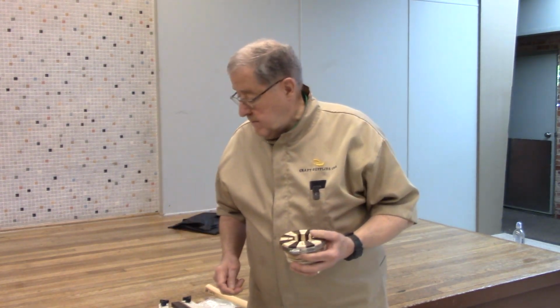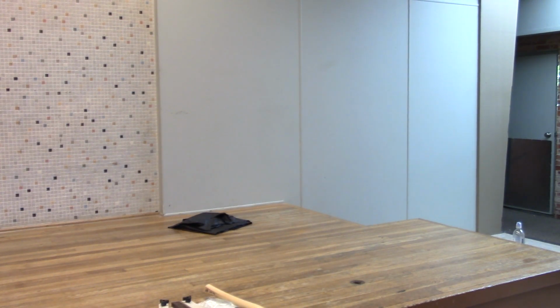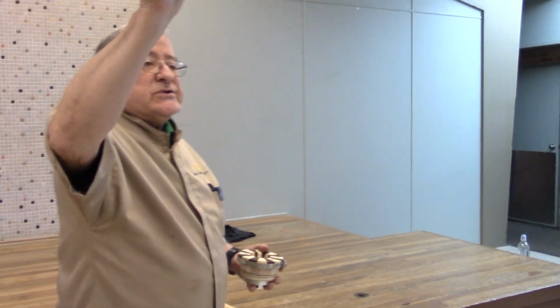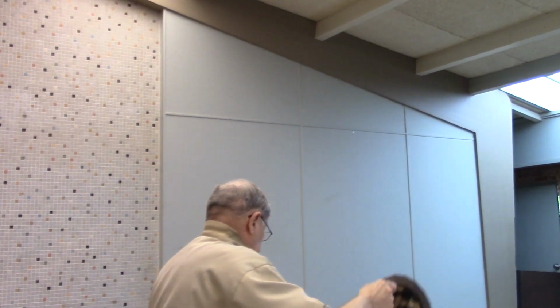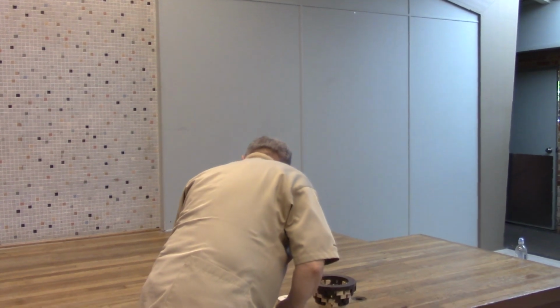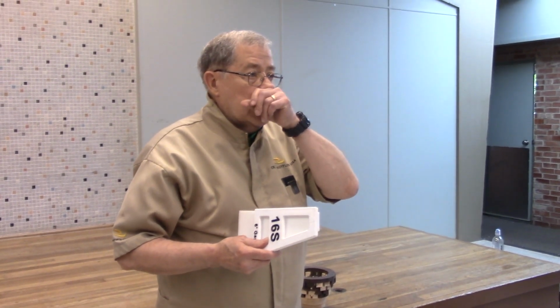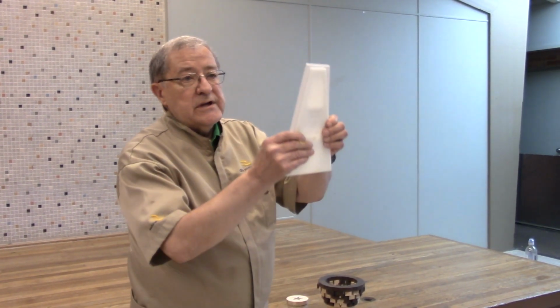which is over there. Yeah. Now, this is an open segmented piece, but you can see how they glue together. So I'm going to just set this one aside and then Michael can make these wedges for you, but don't do what I did as thinking that 16 segment wedge was the same for open segmented as it is closed segmented. It's not. You can see the difference.